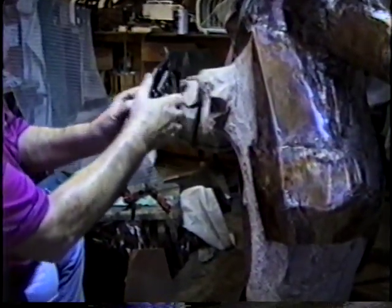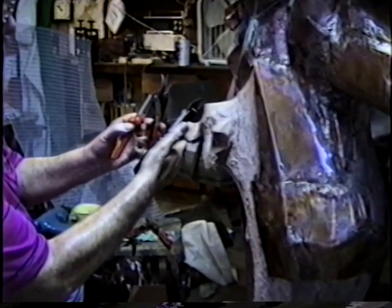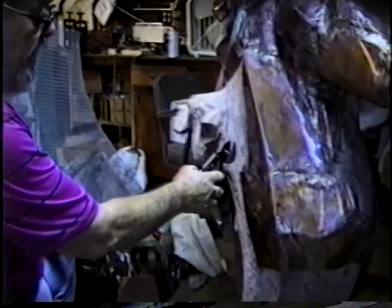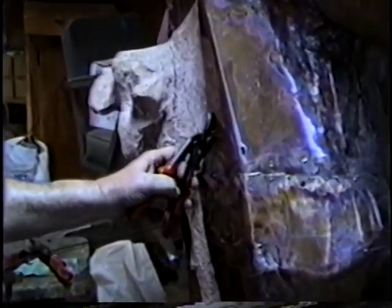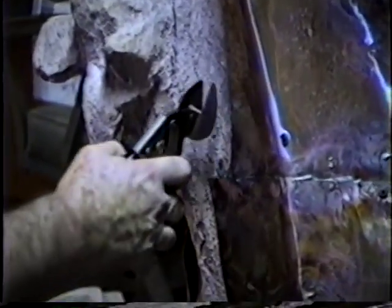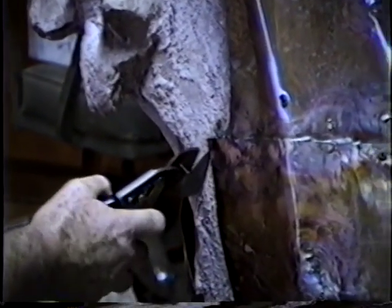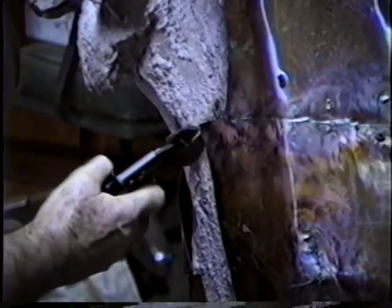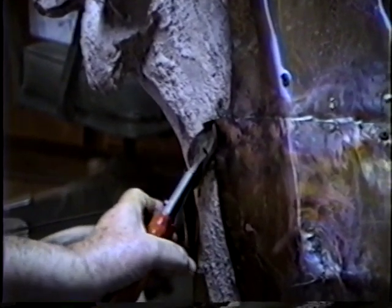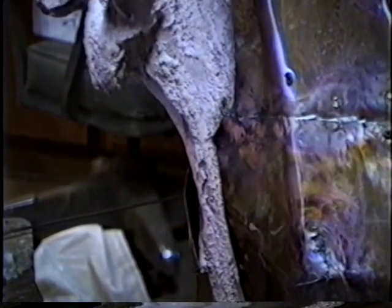Right-handed and left-handed tin snips. So you can see that the blades are opposite each other. So the one handle is black and the other is red. So if you wanted to cut a shaving off of this, that wouldn't work. But here, it would. So there are times when you can use a right-handed, but you can't. Say I wanted to cut that corner off. It would be very difficult to get at it with that snip. But with this one, it goes right in and works.